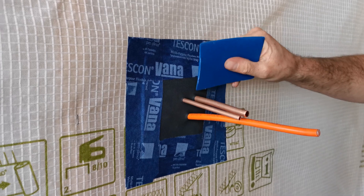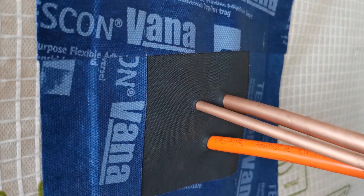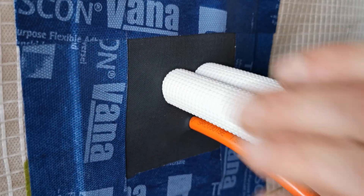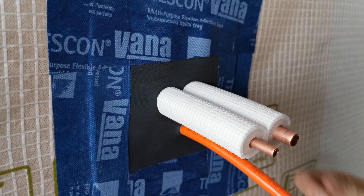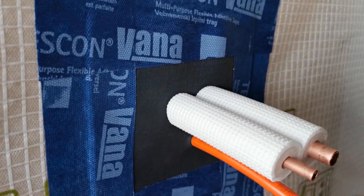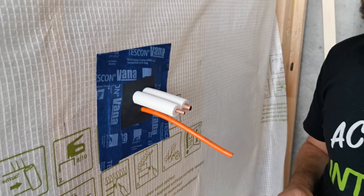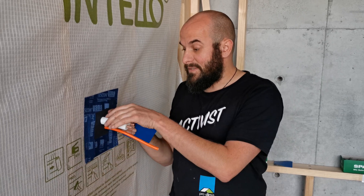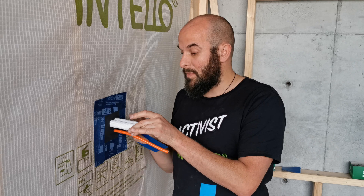As you can see now, the insulation sticks here on the inside, which is good. Because now you just put on the last piece of insulation again — really put it on top, tape it or jam it a little bit. This is definitely the best way, because now we have an absolutely airtight connection for the cable. If you have waste water ducting as well for condensation, just use the Roflex 20 — it's definitely big enough. Same process: remove insulation, fix it with the grommet, and seal it.